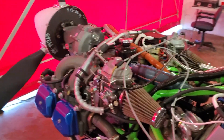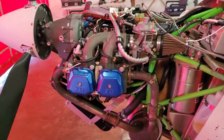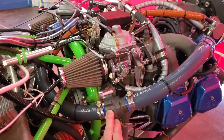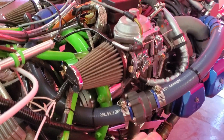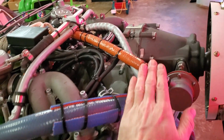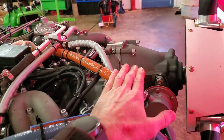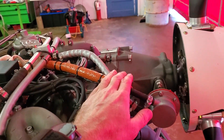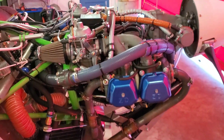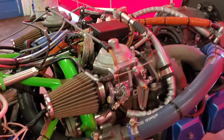I have a couple of complaints, but they have nothing to do with the fact that it's a copy — it's the design of the engine from the original. One of the things we did — and I'm saying 'we' because Brent is my not-so-silent partner in this endeavor — is we didn't like the Rotax 912's warm-up. The gearbox runs off the same engine oil as the rest of the engine, and this gearbox oil needs to be at a certain temperature — 120 degrees Fahrenheit, about 50 degrees Celsius — before you can go full power. Typically 912s take between 10 and 12 minutes to warm up, and we didn't like sitting around on the ground that long, so we did a couple of things to help that.